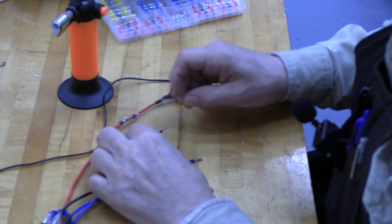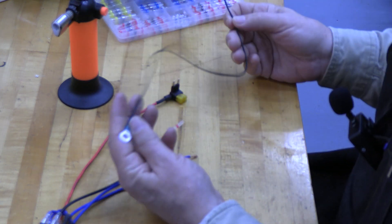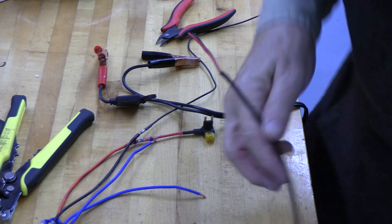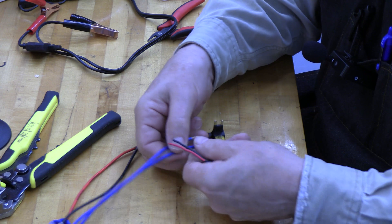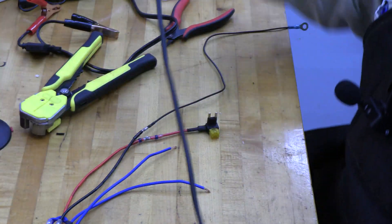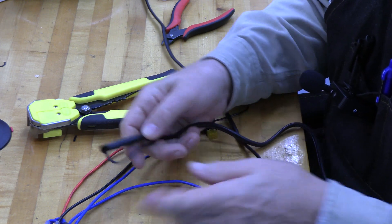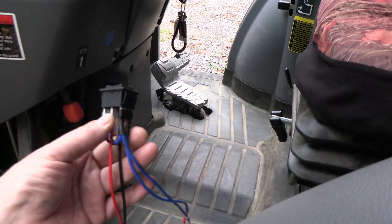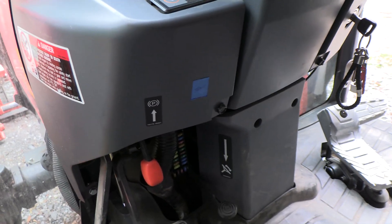So now we're going to hook up our ground. I was able to get this wire into the smaller connector. Now the wire — I just hooked a piece of black wire with a connector here — we're going to hook it to the frame, which serves as a ground. So I've got a length of two-stranded wire; I'm going to strip the ends. We're going to connect those to the two blue lines, which is going to power the actuator. And at the end of this line, we're going to hook up this quick connect, which will allow us to just quick connect to it. It's got a nice cover so it'll stay protected while it's not in use. I identified the side of this switch — it's 20mm by 30mm, so it should be a nice tight fit, exactly where I'd like this. We're going to cut the corner, cut on the edge of this, and make a hole using this oscillating multi-tool.